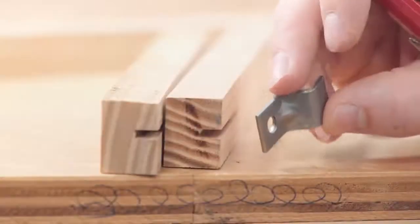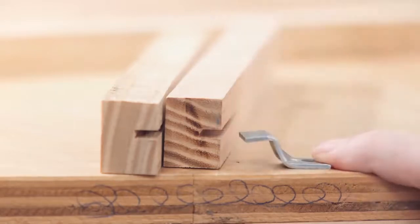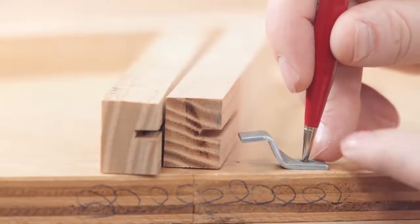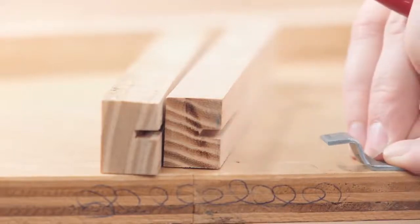This is one of those tabletop hold down clips that I've been using for many years. It's just a Z-shaped piece of metal that has a hole in one side. The hole is where you screw through and into the tabletop or the chair seat to attach it to the frame down below. And these are important to use a system like this because it allows for expansion and contraction